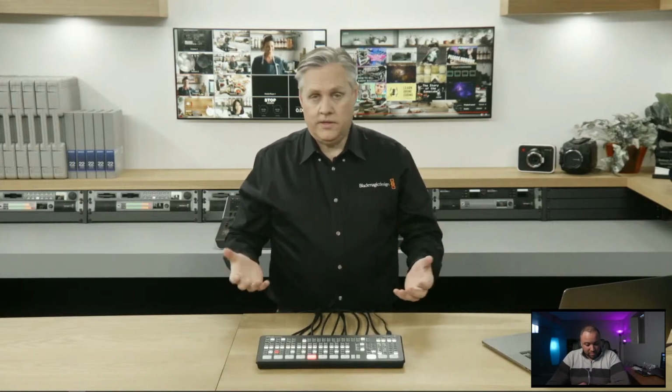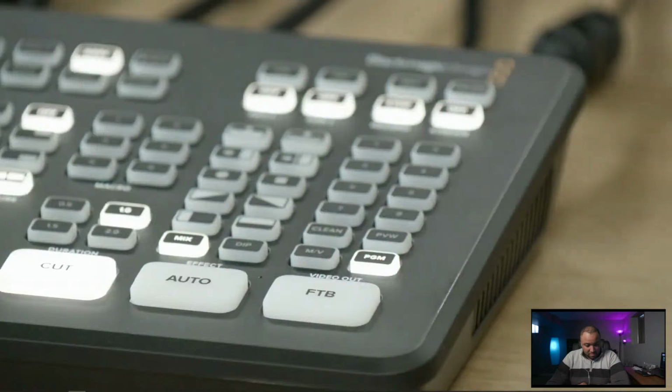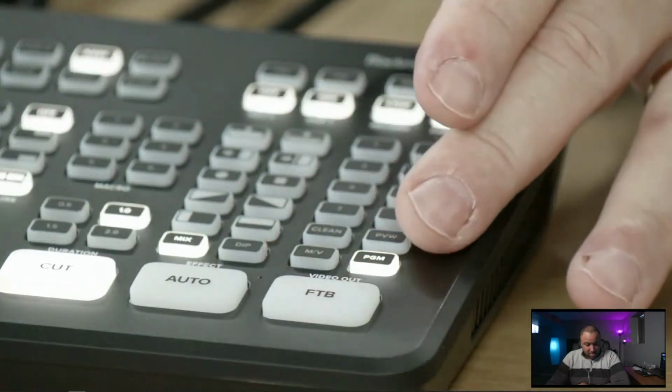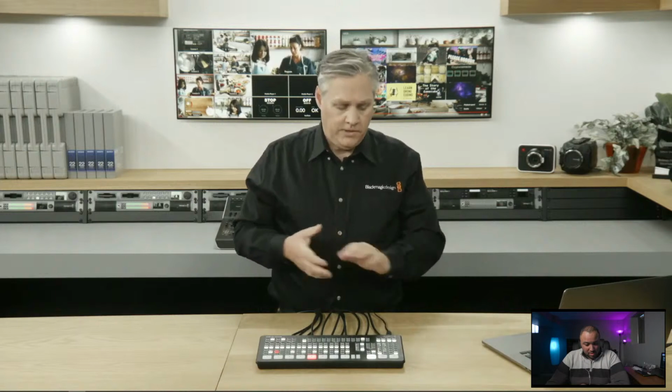There's also upgraded video output controls because we've got more sources now. The HDMI video outputs are actually like aux outputs, so you can route video to them. Output HDMI 1 has settings on the control panel here, and so you can see the location of where they are. Now you can route sources out using the ATEM software control, where you get access to both video outs and you can use them both like auxes, but you can view it on the front panel here.